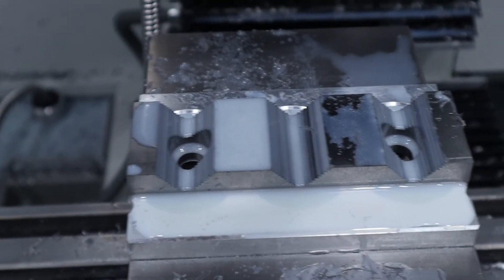All my roughing passes are done. That was using the flat end mills. I started out with a half inch that went as deep as it could and worked its way out, then a quarter inch which could go a little bit deeper and make a tighter V, and then an eighth inch was the last pass. So now I've got a pretty good V but it's like stair steps. I'll admit it has been a little sporty. I think I put my tool loading a little bit too low, so I was rubbing a lot and getting a high pitch squeal, especially on the adaptives. I ended up cranking my feed all the way to 200% on the quarter inch — it didn't really help but at least it made it quicker.